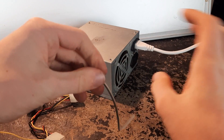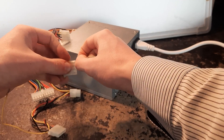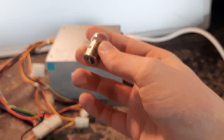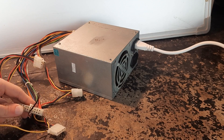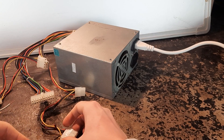Molex connectors are great for testing. Nothing. A little light bulb made in Japan - it's 12 volts, 8 watts - and it immediately turns off. I suppose I could load down the 5 volt rail instead and see what happens.